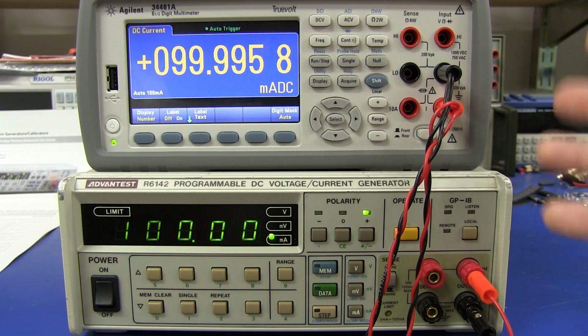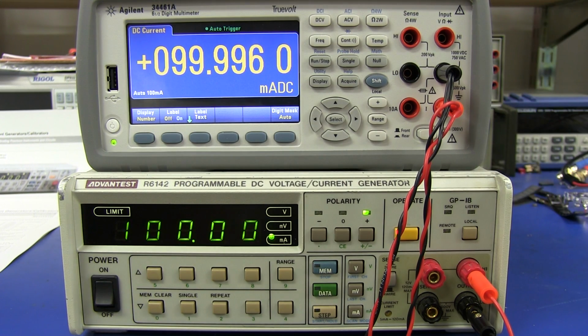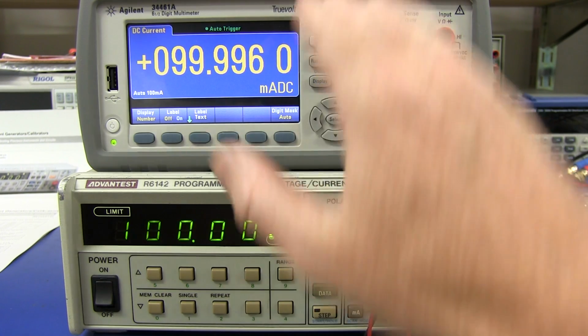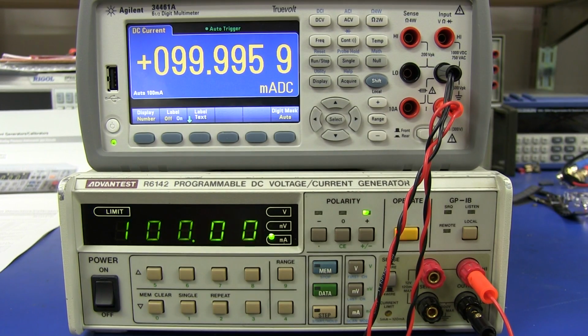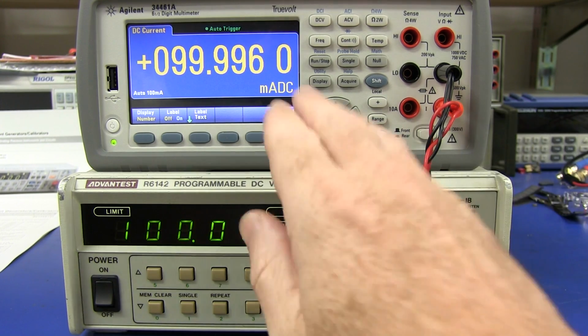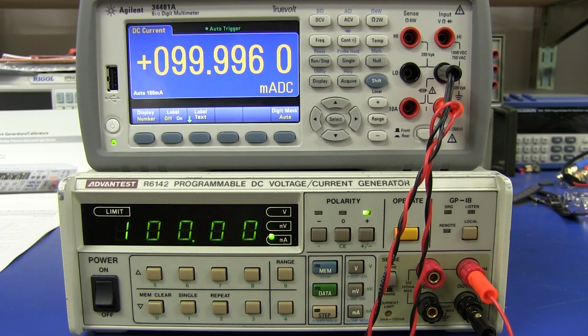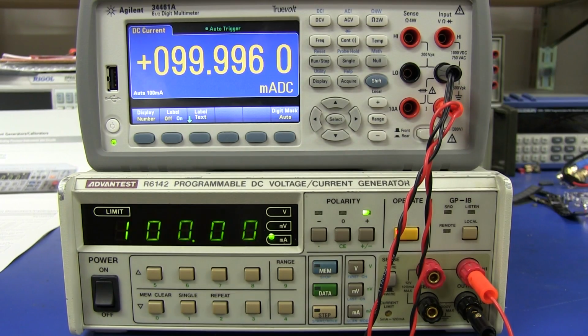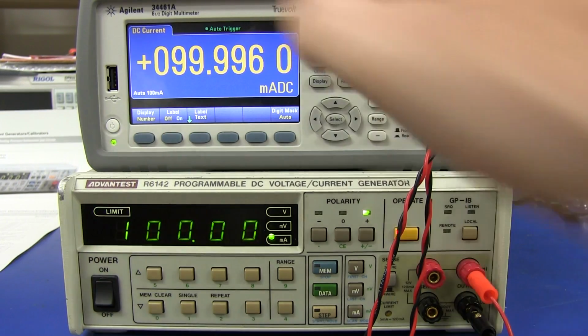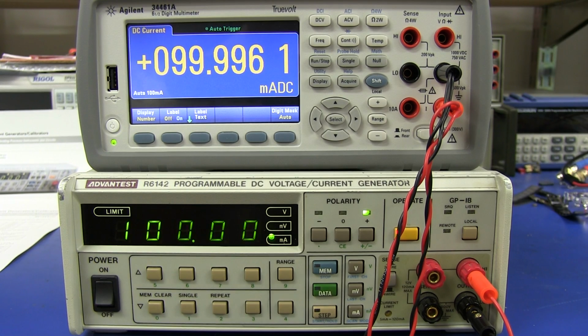But hey, these two units being almost bang on together gives you really good confidence that both units are working and are well within specification, that's for sure. And of course, as I said, I've got other transfer standards which I can use to test precision voltage sources, precision resistors, and stuff that I can use to verify and sort of calibrate, in quote marks, my Agilent 34461A here, and I know it's well within specification, so very, very confident about this puppy.